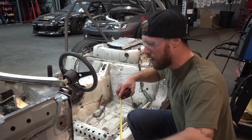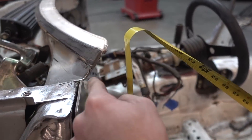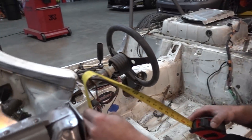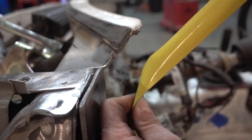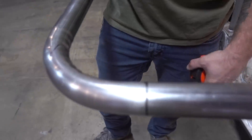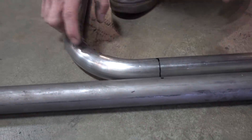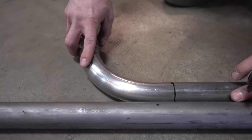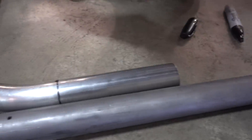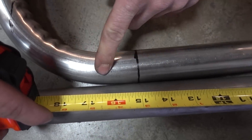I kind of want just an idea of where I want the first bend. I want it to start to bend about here, so it kind of meets up here and doesn't look too high or too low. It looks like 16 inches is kind of where I want to be. From there I'll get my test piece, which I've bent before, and it shows where the bend starts so I can kind of measure from there. If I start the bend at 16 inches it would be too high, so I'll shoot back a little bit — looks like I should shoot for 15 inches, because that's about where the bend should start. I'll have a little bit more here to cut off if I need to.